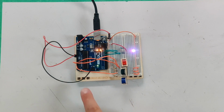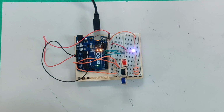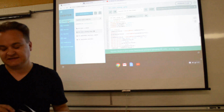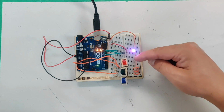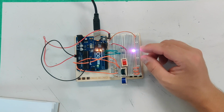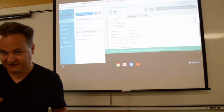These are very flexible. Now, in your code, depending on what you get here, you convert it to how much flash or how many pulses come out here. So are you going to send lots of pulses? If you block the blue, the analog in gets a lower number, and it tells the pin that connects to the blue part of this color mixing LED to send less blue, which makes it seem more green and red, which becomes orange, right? Green and red blended is orange.